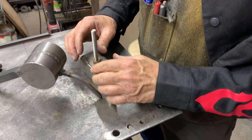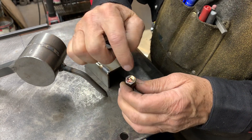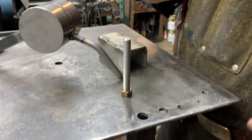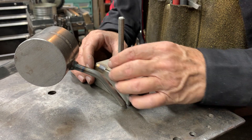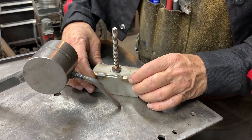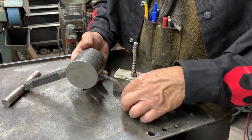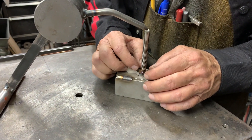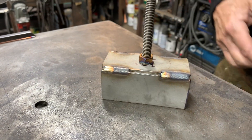I take the nut that's already welded — I've got the all-thread welded to this, and I held the all-thread down below the level of the nut so that the nut sits very squarely, and then I can put it on the parts. On all of them, I've taken the two flats and put them in this position. I'll turn it, get it centered, put my little hold-down fixture on it, check it's down, and then do an autogenous weld on two opposite corners.